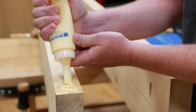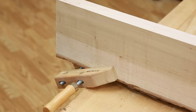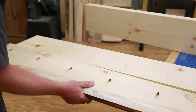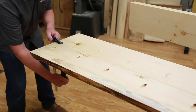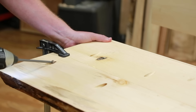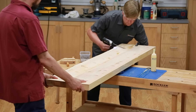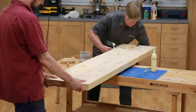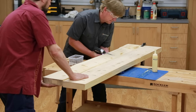Next, apply glue to the mating edges of the first two boards and spread the glue across the entire edge. This wood screw is a good solution for keeping the live edge side standing upright on the table. Lay the boards face down and press the mating glued edges together, then use a clamp to keep the top edges aligned. Drive a Kreg 2.5 inch HD pocket hole screw into the first pocket hole and continue driving screws into each pocket hole, feeling under the boards and adjusting the levels to keep the tops flush as you work down. It's helpful to have another person assist as you go.